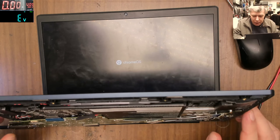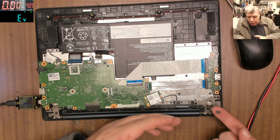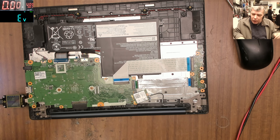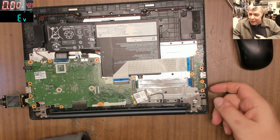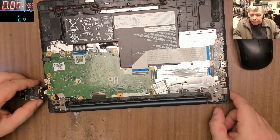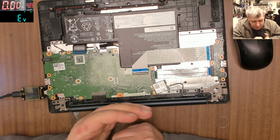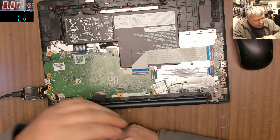The laptop is coming on and working. Because of this little chip — which is not really little, it combines power and data on the same port — we had the whole problem. If USB-C were only for data, that would be fine. But when you bring in power lines and you're pulling 1.7 amps at 15 volts to charge the battery, that's a different story.